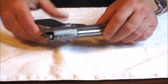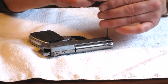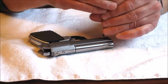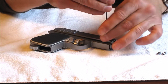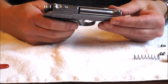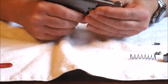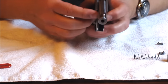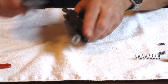The first step to disassembly is to remove the slide. To do that you have to remove the front spring retainer block. The slide comes back to a lock position because I had welded the front of the tracks closed, so you just spread slightly and pull off.